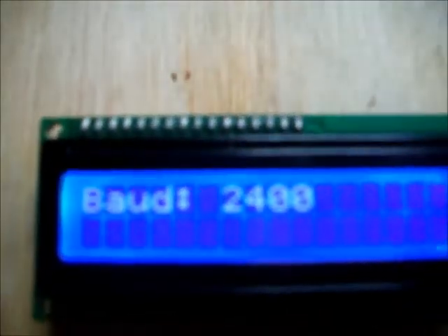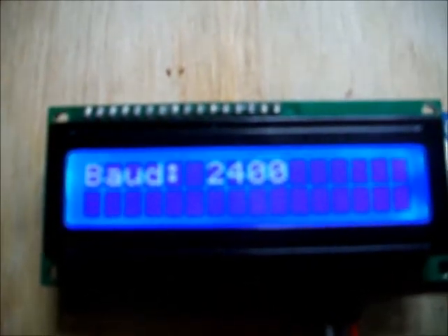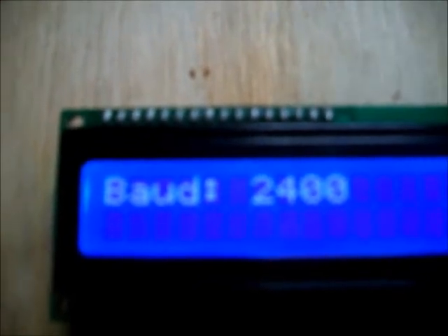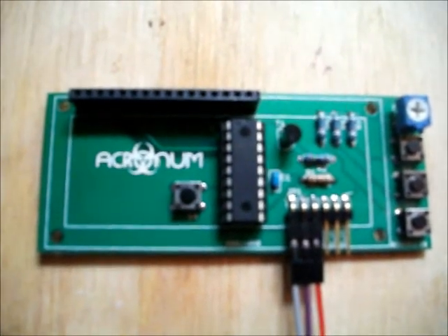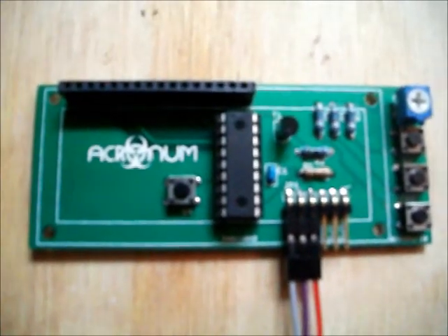Now I'll turn the backlight back on — like so. And you can see the text there. Now if I clear the screen — I can clear the screen. And then by pushing this button again while the LCD is running without power cycling, the current selected baud rate will come up on the screen. So if you're not having a baud rate error or anything, you can just leave the LCD running. It'll automatically clear the screen and show you that when you push the button, so you can see what baud rate is actually selected. That was my demonstration of the various parts of the LCD backpack board. I hope that covers everything you need to know. Cheers.